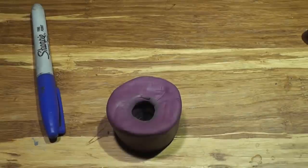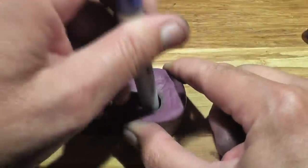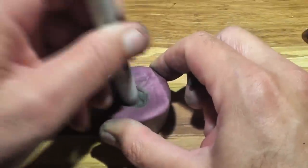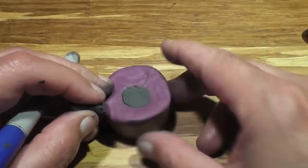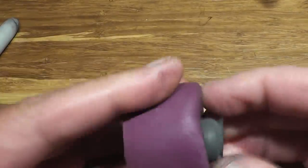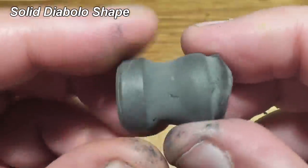We'll be using this silicone mold that Peter Brown himself made for us a while back. I'll just put a little bit in there at a time, tamp it down so that it fills all the voids. The old school stuff took about four hours just to set and 24 hours to cure. This stuff sets in five minutes and cures in one hour. I've lost track of how many things I've fixed with this stuff — it's amazing.